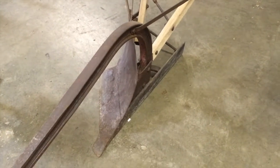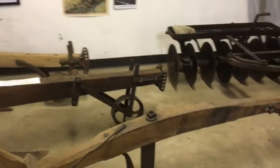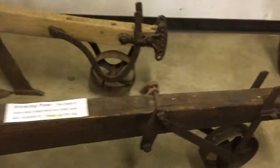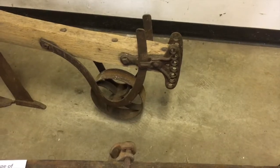The point of the plow had to be pointed down so when you started to pull, it would pull into the ground. The gauge wheels would help hold the depth. You could change the depth — especially you can see on the far one where you have the irons where you adjust that wheel as to how deep you wanted to plow your field.